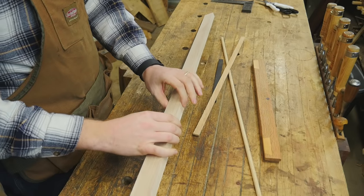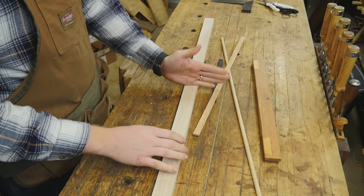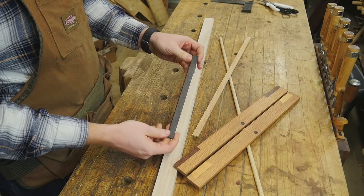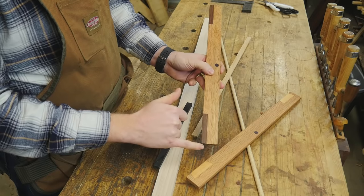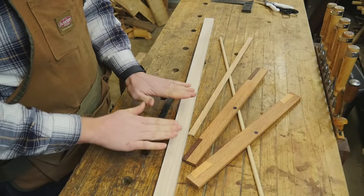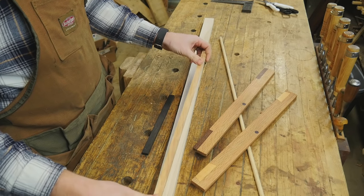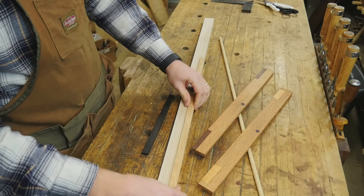This is already planed to be perfectly flat all the way along, but I'm not 100% sure, so I'm going to cut it in half and then match them up. For the dark and light settings, I actually have this piece of ebony that was given to me by a friend in Michigan. I'm going to split it up and use an inset section — a stopped rabbet to hold it, just like on this one. On the second piece, I want to show another way of insetting it, so I'm going to use a full stick — this is actually a soft maple, I believe it is box elder — and put a rabbet all the way alongside and inlay this into the rabbet.